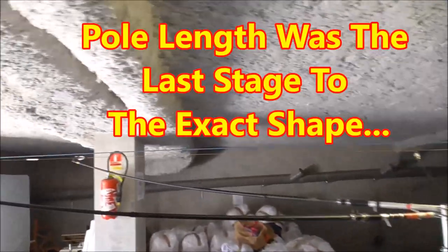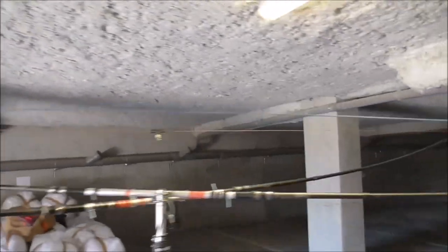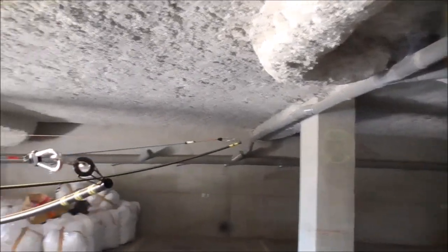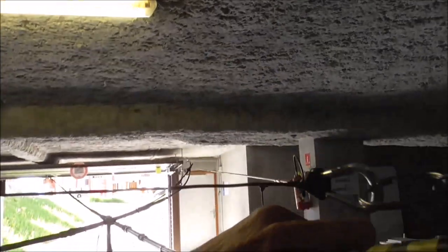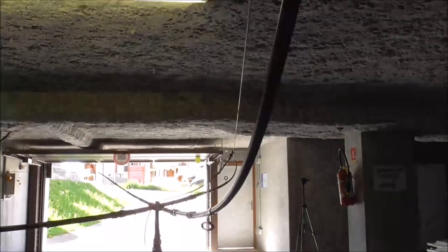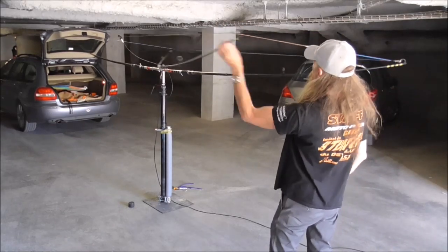As it's set up, you can see the wire is at its 5 to 10 degree up, which makes a huge difference. And it's absolutely parallel and absolutely square. The fact that it's sitting cocked up like this, if it went further over, it would be square, but I don't want it. I want that to be pointing slightly up the way. It really makes it perform. So that's the Moxon. All ready to rock.